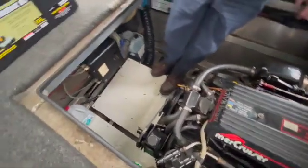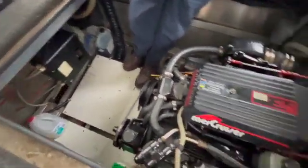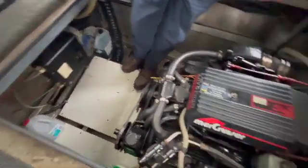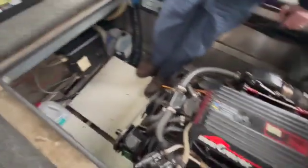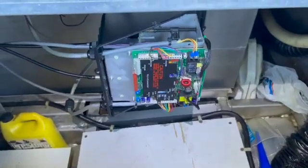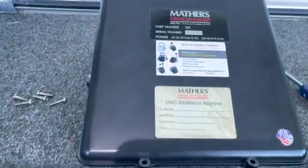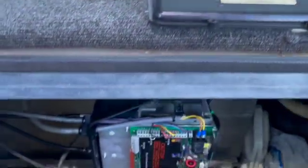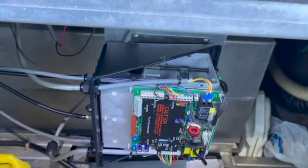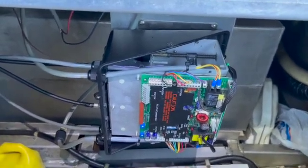Today's project: Mike has Mather's Micro Commanders that won't let the engine start. If we disconnect the cables, the engine starts once we jump the electronics in that box. We talked to some people and they said to take off these cables — that's probably our problem — and then send that box in and see what fixes it. This is a follow-up on a video I started about Mather's Micro Commanders. Lots and lots of boats had these. What the electronic box does is take a mechanical cable system and turn it electrical for the controls of the boat. Very, very nice — put on many, many boats for many, many years.